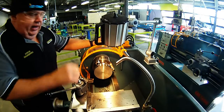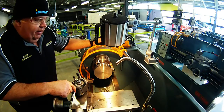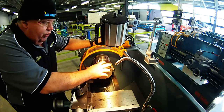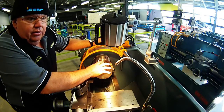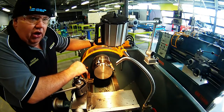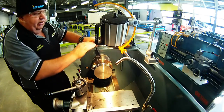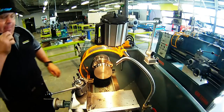I've moved up to my second lathe here in the workshop at school. We've got six of these lathes — I believe they're Taiwanese lathes, but you can't really buy Australian-made anymore. I've got a bit of billet in here, just a scrap I found in a scrapyard. I've got to machine it down to an OD size of 90mm; I'm currently at about 134mm. Usually you'd never hold black steel that's a little bit out in a three-jaw chuck because you run the risk of it coming out and killing you — you'd dial that up in a four-jaw chuck. But I've held it pretty secure. I always check my three-jaw chuck at three stages — never just rely on one. Make sure it's tight enough so it doesn't come off.